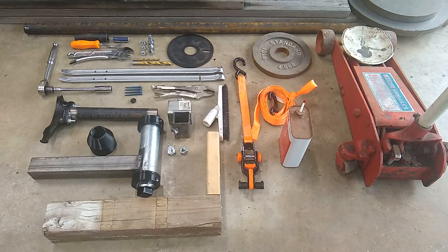Starting with the car jack — on one of my previous videos I show how to manually break the bead using a tire jack, and I'll link that video in the description. The method is the same whether you're breaking the bead on a 185/60/R15 or a 225/45/R18; the only difference is you have to go around a couple of times to get the bead broken all the way around easily.